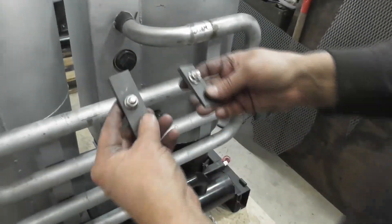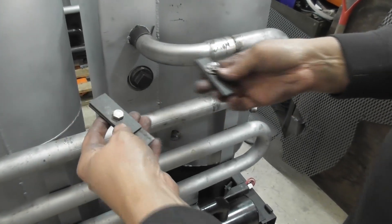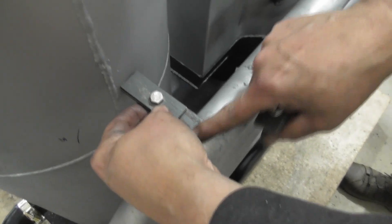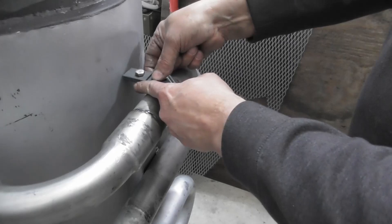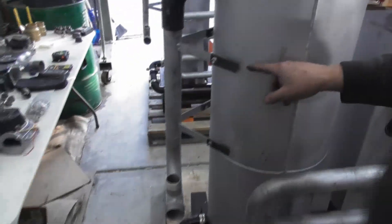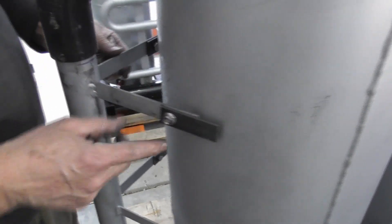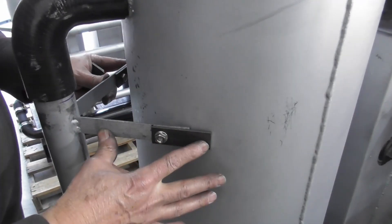Here's some tabs — it's basically two pieces connected by a 5/16th nut and bolt. We're going to put this on and weld one here, one here, then up in here. We'll have welds all the way around here on the gas exit. You can see we've got the braces and the two tabs. So we're going to get everything plumbed and leveled, and then tack weld all these tabs on.